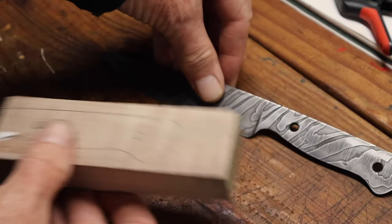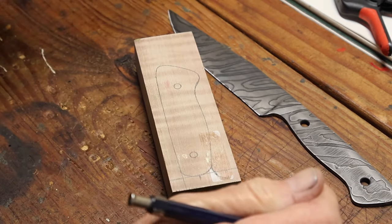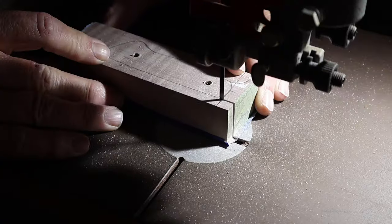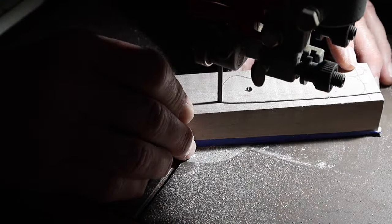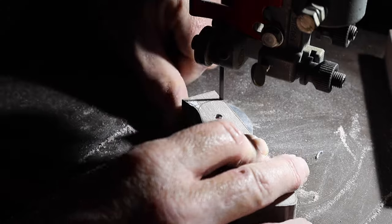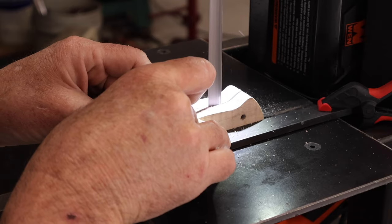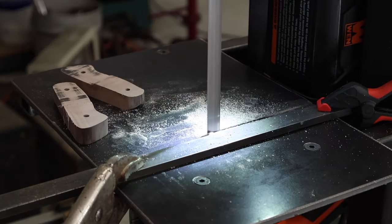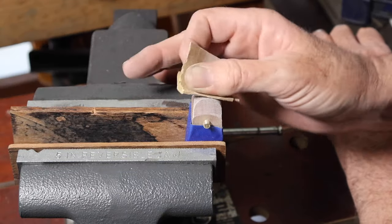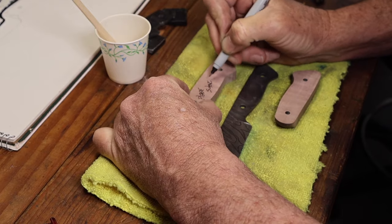I had a piece of maple — a maple block that I used. Marked it out, then went ahead and drilled the holes and cut out the shape of the handle. Cleaned it up a little bit on the belt sander, then split it into the two separate pieces that were going to be the scales. Ground those surfaces flat, and I'm just sanding down the front edge of the scales before the glue-up, since it's really hard to get to that area after it's glued up.